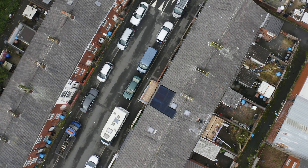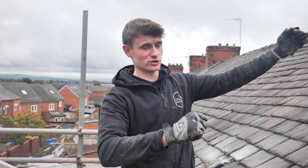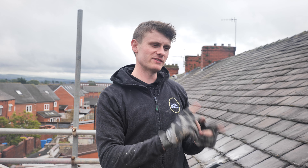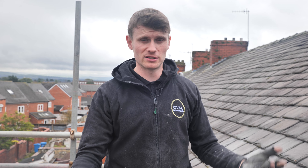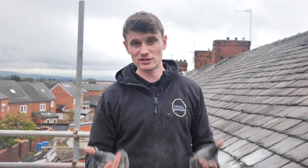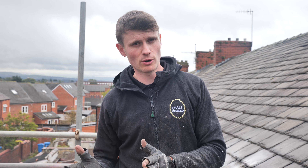This side we're going to have quite a complicated layout: three in portrait along the bottom, then two in landscape along the top, then another one in landscape above those two, with a solar skirt all the way around to keep the birds out and make it look nicer. It's a bit of a different setup — we're not fitting SolarEdge on this one, mainly due to budget. This is going straight into the Alpha Smile 5 battery storage system as a DC coupled system. The solar PV connects directly into the battery inverter, which can then direct that DC either straight into the battery or through the inverter and into the home.